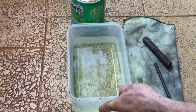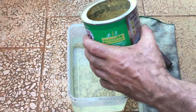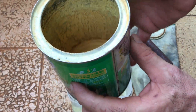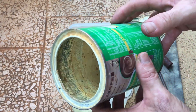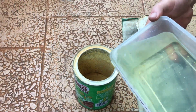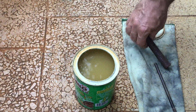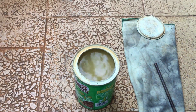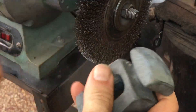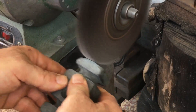After one use, my water has a little bit of a yellow tinge. What I want is to get that water to become more yellowish, almost yellow-green. This old metal container — which had an old batch in it — should help supercharge this water. What I've noticed is that when oxalic acid in water comes in contact with steel, it tends to change and become murky, and actually the oxalic acid will fall out of solution after some time. That's what you're going for.